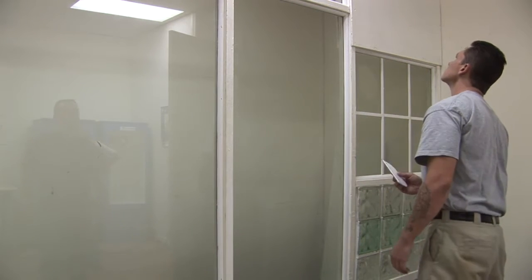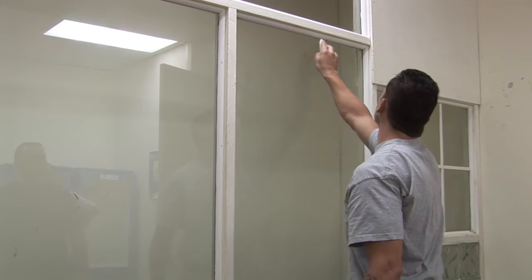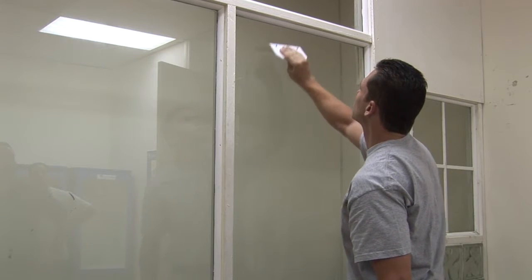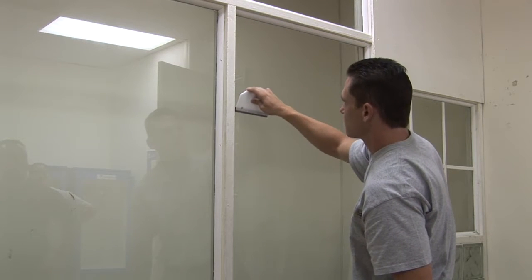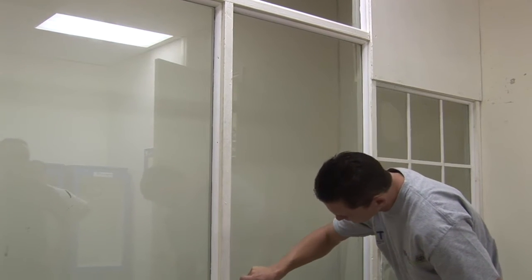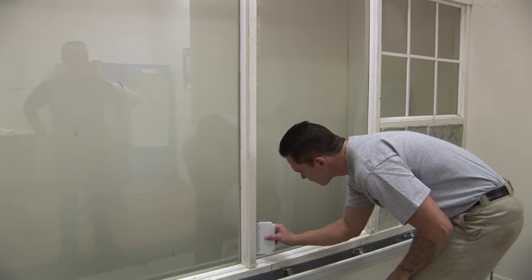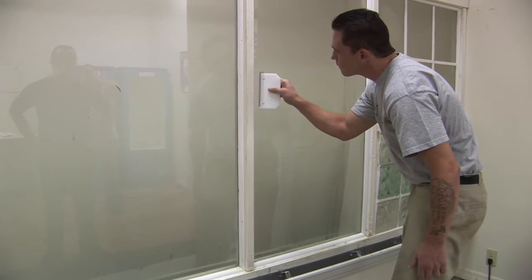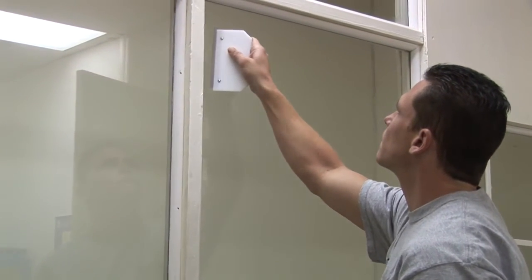We sprayed the glass here just with clean water, nothing special. And then we scrape the whole of the glass surface, making sure we go carefully into the edges. What this does is if there's any little bits of grease or dirt that's stuck on the glass surface — maybe the house has been painted and there's a few spots of paint stuck on the glass — the scraper should remove all of those bits of stuck-on dirt. We make sure we scrape right into the edges, because generally speaking most of the dirt, and particularly things like silicone when the glass may have been installed, get into the edges of the glass.